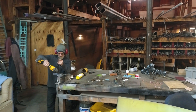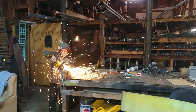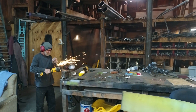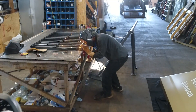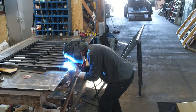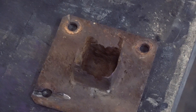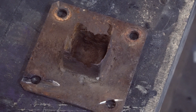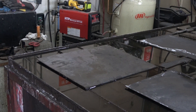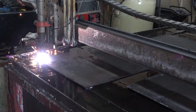Tommy's cut off a section of inch-and-a-half square tube at the miter saw — just put a 90 on it — and then by hand with a cutting wheel he's going to match the angle he previously cut into the gate. We use an angle there for two reasons: one, it does lead to more weld area, and that diagonal that gets welded kind of stiffens everything up, especially with that sleeve inside. And also, it lets us get as much of the old steel removed and fresh new steel put in its place.